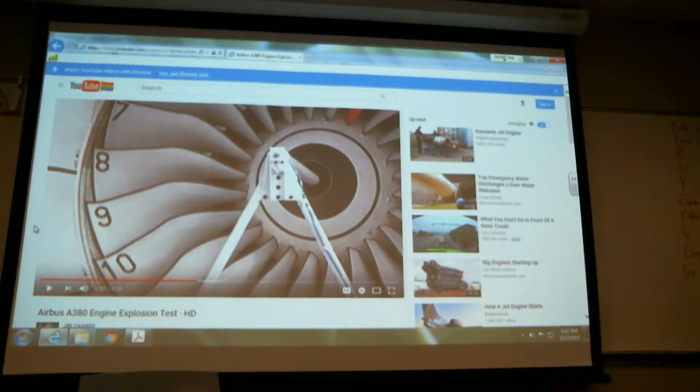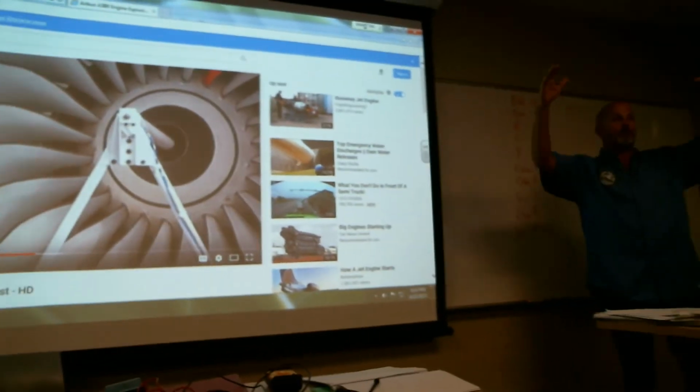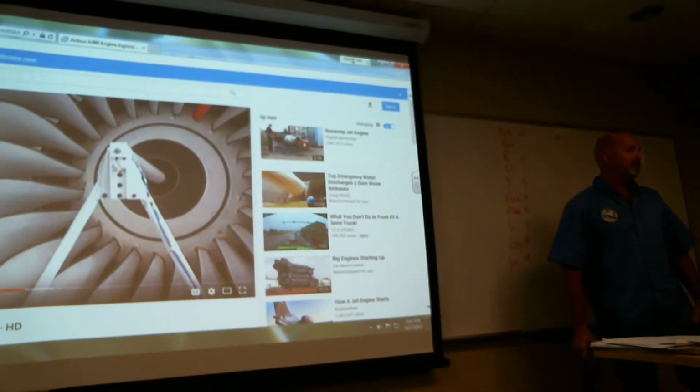The majority of your thrust comes from this high bypass, the cold airstream. Yep, the cold airstream. This engine out here does not have a cold airstream, it's not a high bypass. In fact, I just ran across it. There's a picture of me at TWA way up in the cold airstream. Look at the back of the engine. If I see it, I'll bring it in.